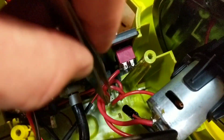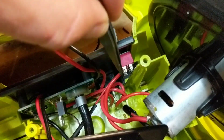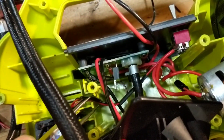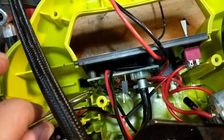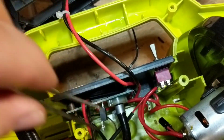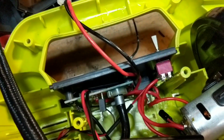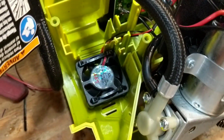I've installed a little power switch for the fan. The center terminal on this switch is where I'm taking off the positive power, running it to my switch, which runs it over to the fan. Then the ground or negative from the fan goes down here and connects up with the board where ground is coming in from this wire here on the back side of the board. So it's just stealing 18-volt power for a couple of little fans.